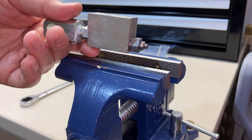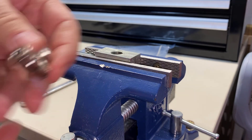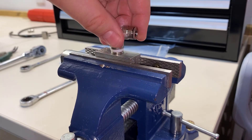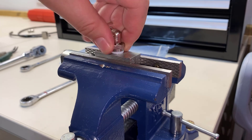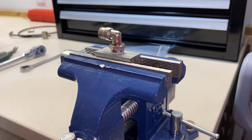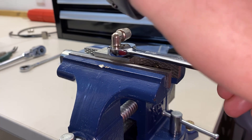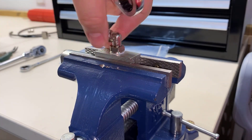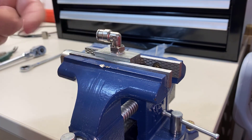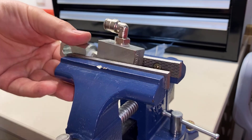I need to step over to my vise real quick again because there's a fitting that installs into the outlet which is going to receive the tubing that runs back to the reservoir. This doesn't need thread sealant because it has a white sealing ring on it, and this is a swivel so it doesn't matter where you end up pointing it when you're done — you can change it later. I'm just going to get this till it pretty much wants to stop. This fitting really isn't ever going to see much pressure since it's just the return to reservoir, but you still want to get it in there good and tight.